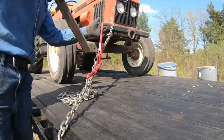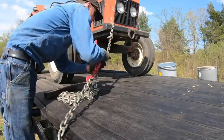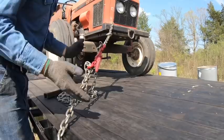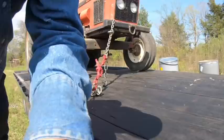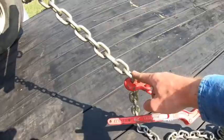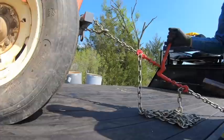With this, even with the cheater bar on here — this first one I could force if I wanted to. But let's say this is a little too tight. If I were to take a full link out of the equation, now it's way too loose — I mean, it's doable, but I want it a little tighter than that. So how do you get a halfway point? What we do is this: when we come around and make an adjustment here, this takes a full link out of the equation. When we move this — since this goes around whatever we're working on — it changes this to half a link at a time. That's the most valuable trick that anybody's taught me with these chain binders.